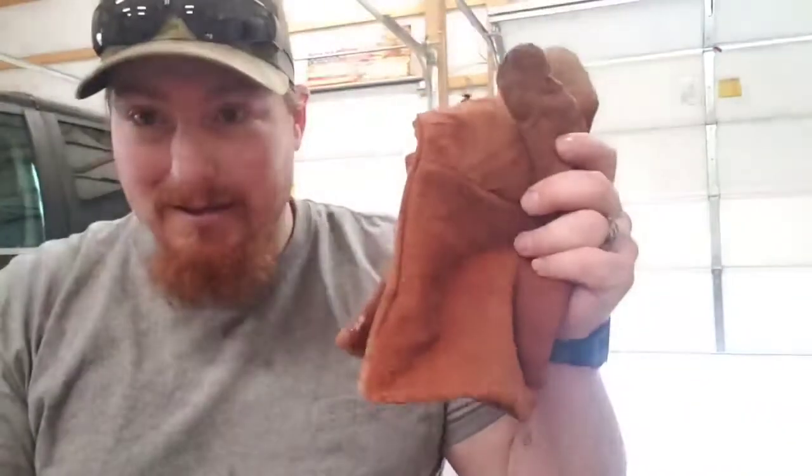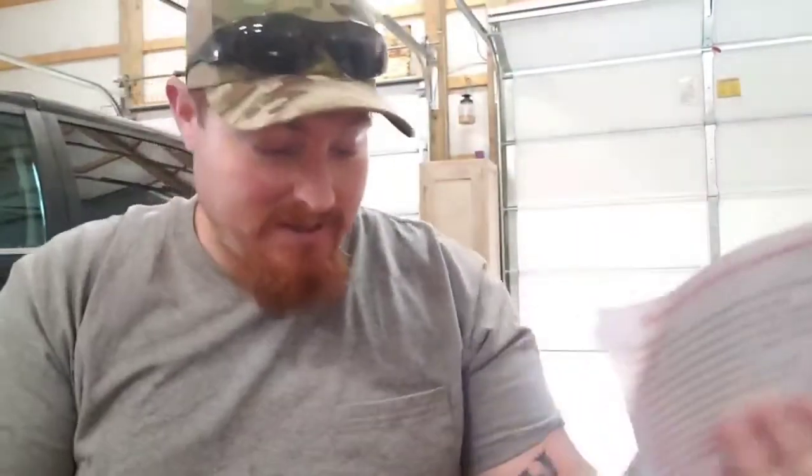So, got my gloves, these safety glasses. I got some clear ones if these are going to be too dark for me. I went ahead and, like I said, read through this. One of the important notes it says is that you want to preheat your crucible because you want to get all the moisture out of it, which makes sense because you don't want molten metal and water combining. Yeah, that just seems like a bad idea. I know it can kind of make a steam explosion and throw molten metal around. So, another reason for the gloves. These are like thick welding gloves. I'm assuming they'll work.